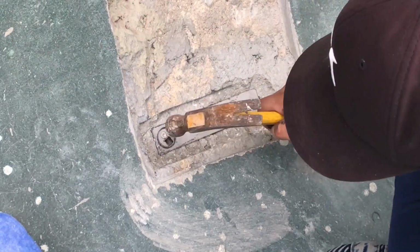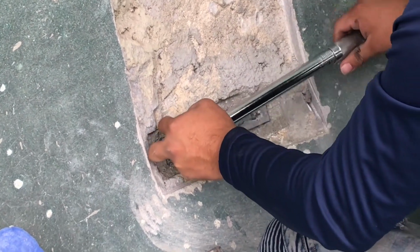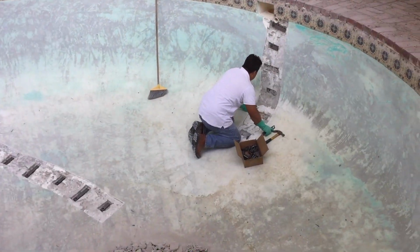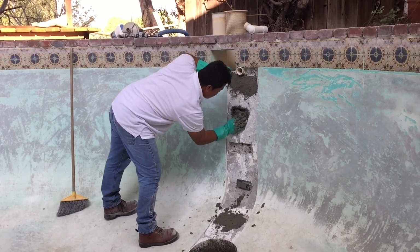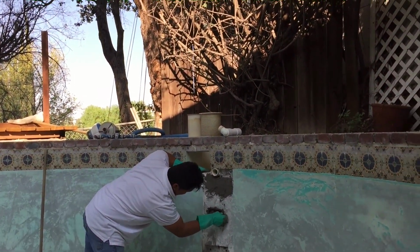Then we set our staples, we use an epoxy, and now we're gonna compress this to 22 pounds. That's what we typically use in gunite and shotcrete. Then we set all our other staples. And then the next step is we're gonna pack it with a hydraulic cement. We're gonna keep that from getting any water to those staples. And we never really have any problems with bleed out.